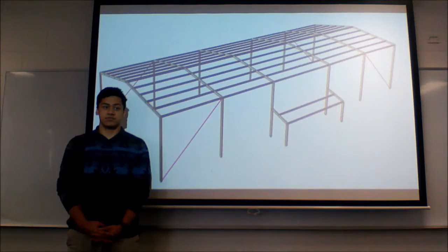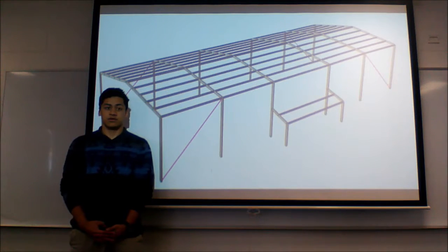Next, our team had to identify how to efficiently iterate the sections to obtain the most economical but safe members. In doing so, we decided that stronger bracings with lesser circular hollow section capacities would be more economical, as there were only 4 bracing members, but 10 circular hollow sections. Iterations found that the most efficient combination that ensured structural stability were the 48.3 by 3.2 circular hollow section members with 30 by 5 equal angle bracings.